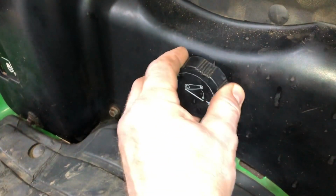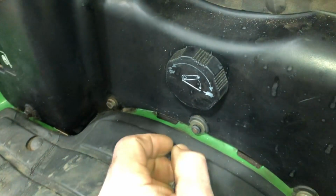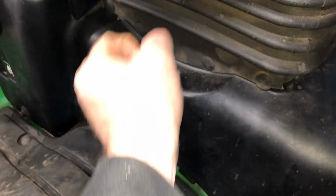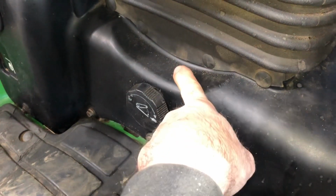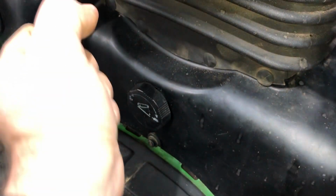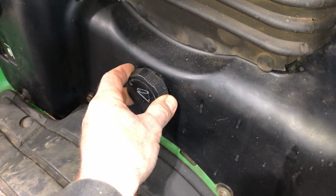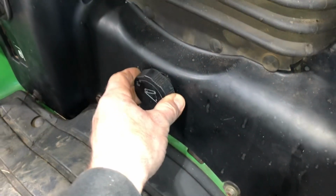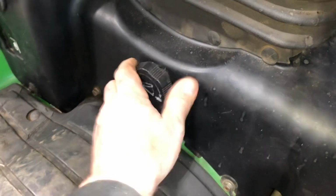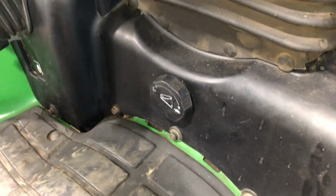So if you do this a lot, left and right, and you really can't make any progress by freeing it up because it's just too frozen, what you're going to have to do is pull this plastic off, and you're going to put a pair of vice grips on the shaft. Put the vice grips about 2 inches back behind the knob, not touching the housing of the rocker shaft area, and use the vice grips on the shaft, doing the same thing, left and right, a lot, and then eventually that shaft will become unstuck, and then you can turn it all the way in either direction. You want to turn it all the way down and then back it all the way off a few times. That will get you back to where you want to be, where you can actually use this functionality. And that's pretty much it.